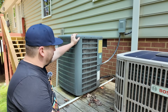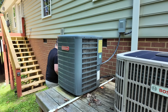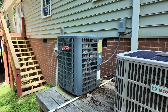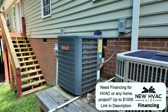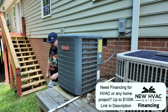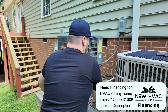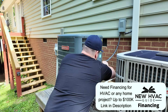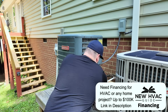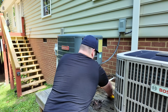We're starting with our Goodman, which is probably about 10 years old now — still the same technology as a lot of the 14 and 15 SEER equipment out there today, other than metering devices and coil sizes. Most single-stage systems I would equate to a light switch: it's going to turn on and off, no modulation, no ramping up and down. Because of that, you get spikes in energy whenever it kicks in — the amp draw will spike significantly.